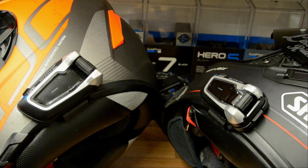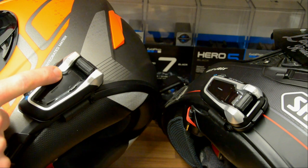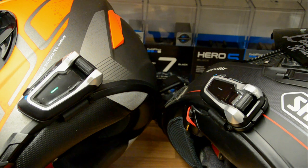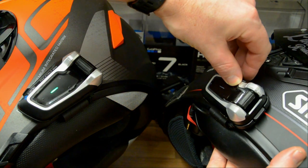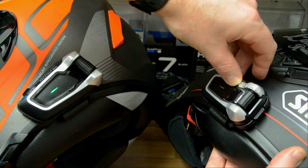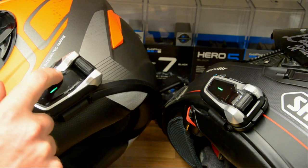This is a one-time operation — you only have to do it once. After that you just turn the units on into DMC mode and they connect automatically, but we have to set up a group first. All we do is press and hold the top button for five seconds. I initiate the call from the master or control unit, and we do the same on each individual person that wants to join the group. Then as the controlling unit, only I have to press the top button again once.